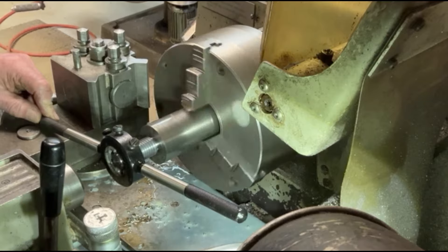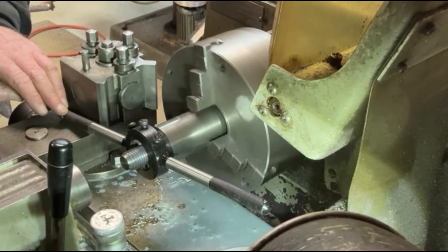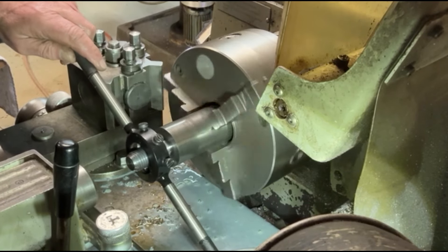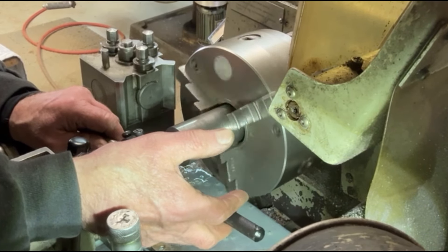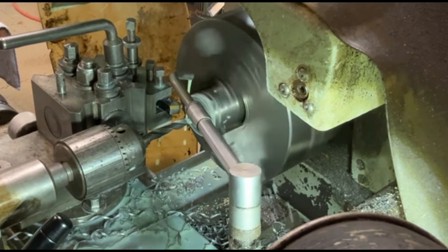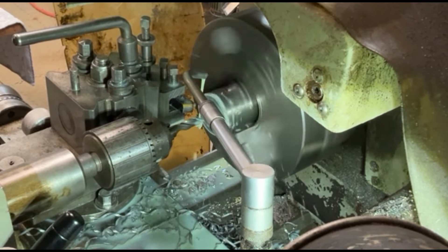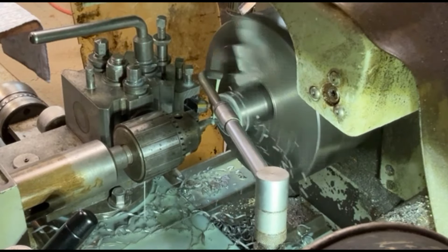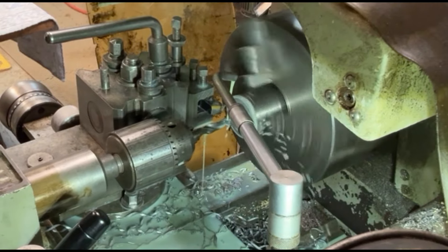Here I'm just finishing off the thread by running a die down. To put a die on without putting the thread on first, it's a bit tricky to try and get the thread nice and square. But if I screw cut it first to get the guide on the die, then that keeps it all nice and square. Here I've turned the bar round the other way in the chuck so I can drill the end where the cone is going to be machined on. It's got to have an M12 thread in it, so I'm just drilling out the tapping size.